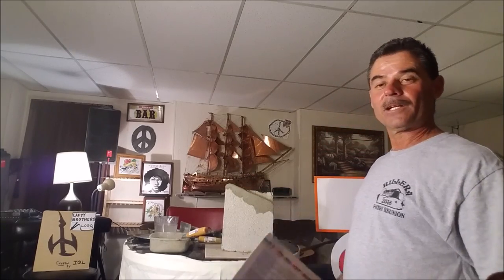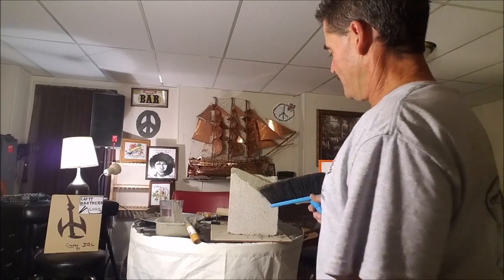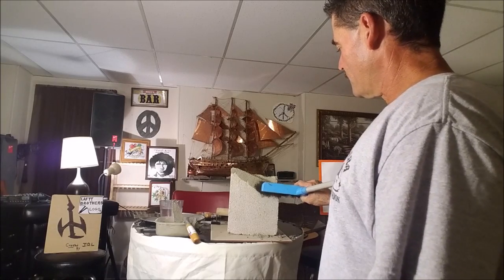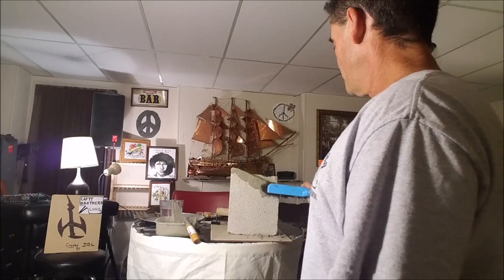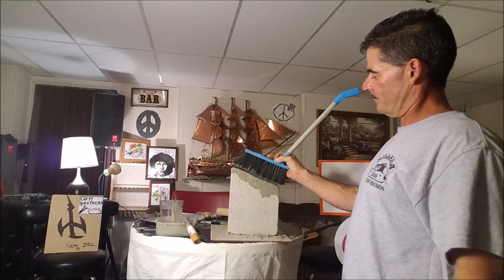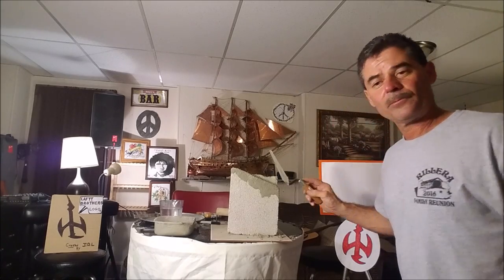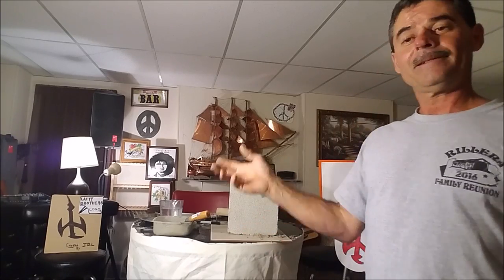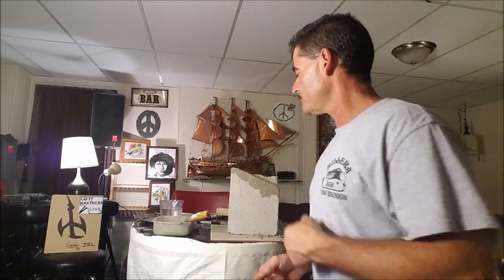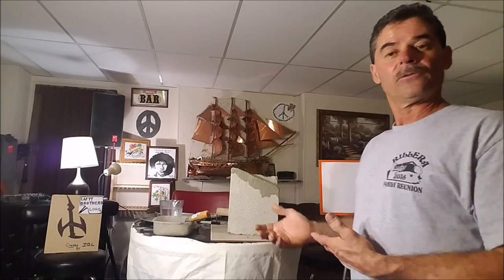Look how we're going - this thing's just about ready. You've got your triangle piece. This is basically a quick thing - I know it's a mess here but I'll take care of that. They do this thing with it called stippling. If you want, sometimes you wet it first with your brush while it's still curing, and you get a kind of texture almost like a cinder block texture. Keep that top edge if you want it nice and smooth. It's not going to be perfect, but once you put a coat of paint on that, no one's going to be able to tell the difference. You didn't hire a contractor, you had it in your garage. You used Tupperware, a cup of water, a tray from your hoagie tray, a piece of trowel.